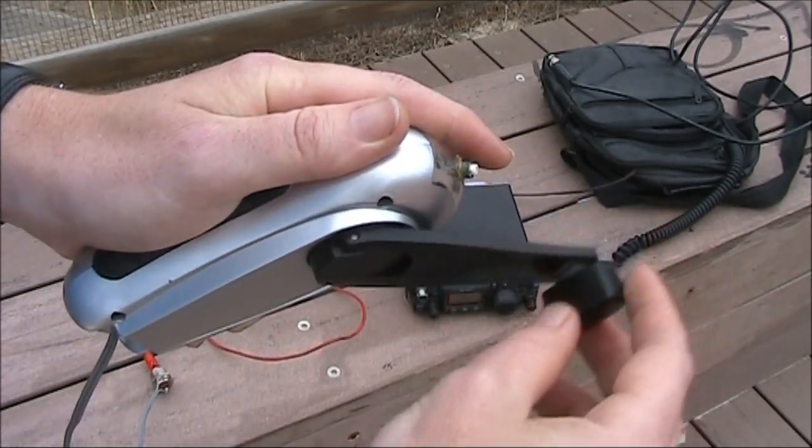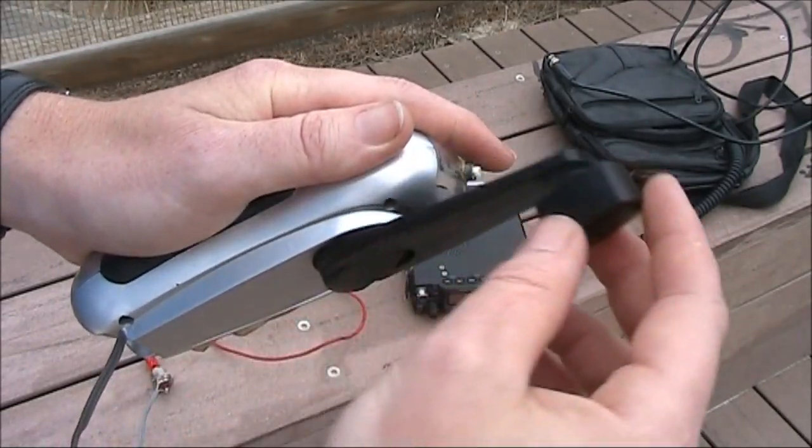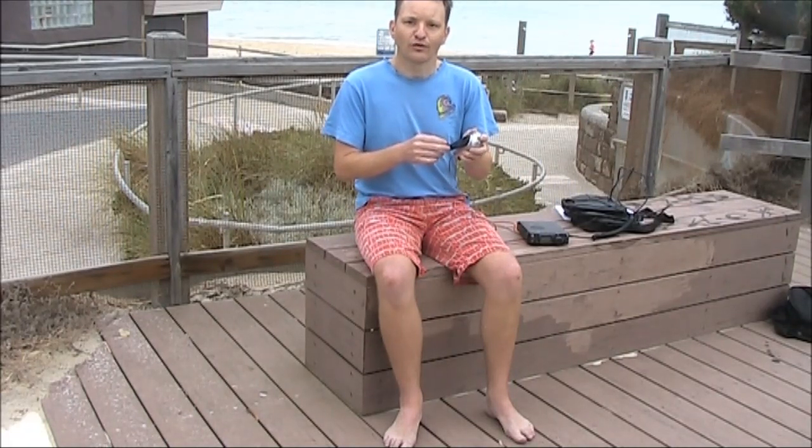As you can hear, the oscillator takes very little power and only slow motion is needed to energise it. How far can a transmitter like this get out? After all, it's only 500 milliwatts — less if you're tired. I've been identified at distances of around 400 or 500 kilometres, and the signal's been detected at around 700 kilometres. That's pretty typical for 40 metres QRP, and your results should be similar. Some people say there's enough cranks on the amateur bands, but I reckon there's always room for one more — especially if it's of the human-powered variety.